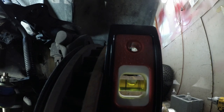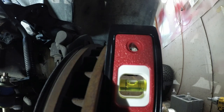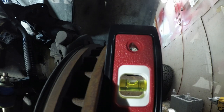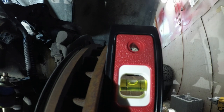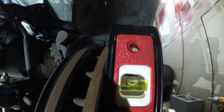The key is to get the bubble in the center — that'll be plumb. But apparently you want positive camber at 3.5 degrees. So before I was negative, this time I want to be a little bit positive. I'm not sure how to measure the degrees precisely like this, so I'm just going to have to guess and give it a little bit. And that looks pretty good — I'm going to go with that.